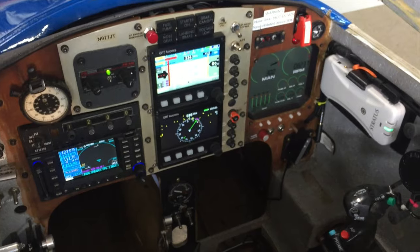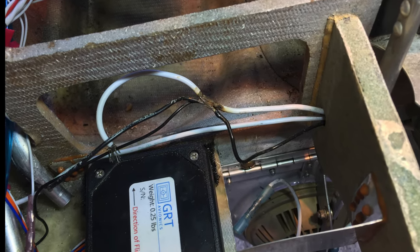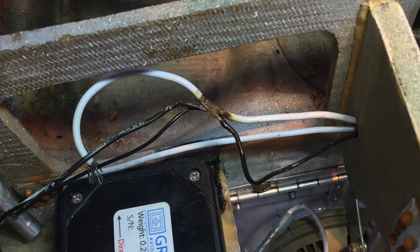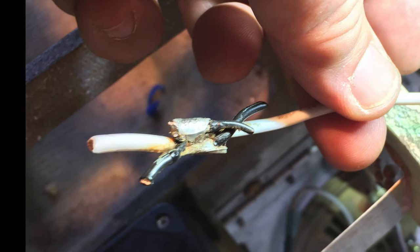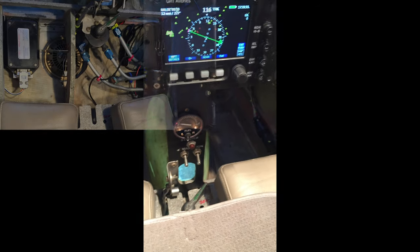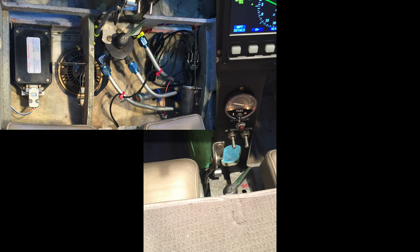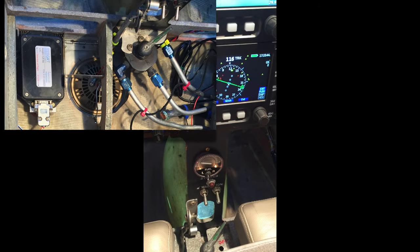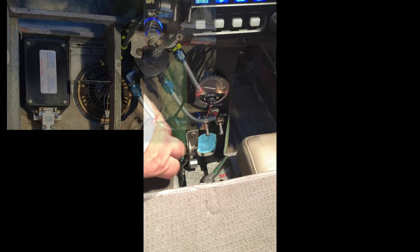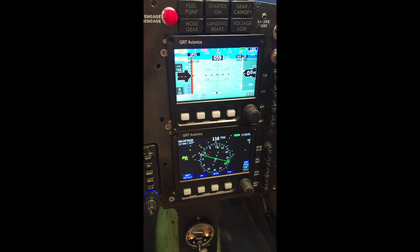As the latest update, that's what we're working on right now. This is a good example of the kind of stuff you don't want to find out when you start digging into the electrical system. The original builder told me he didn't do this, so one of the previous owners must have had some work done by a mechanic and this is what they came up with. After about a month and a half, I've moved all the wires that were going near the magnetometer. Now there are no wires near the magnetometer. Landing light is down and we're going to try turning the landing light on.